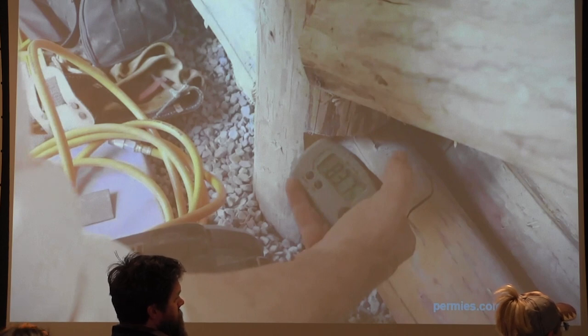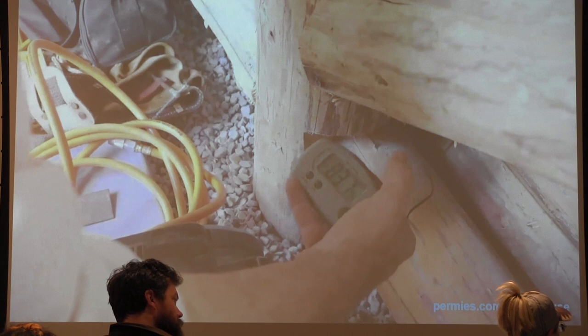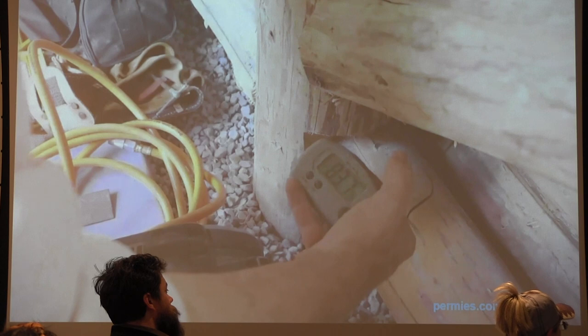It's a very common passive solar technique. What you do is you set it all up so you're going to harvest a lot of sun in the winter, when the sun is, let's see, that's south. So we're going to have our glass like this, and it's fairly steep. When the sun is low in the south, we're going to get a lot of light, and that light's going to come all the way in and hit the mass in the back of the greenhouse, right? And then in the summertime, when the sun is high, very little sun is getting inside the greenhouse.